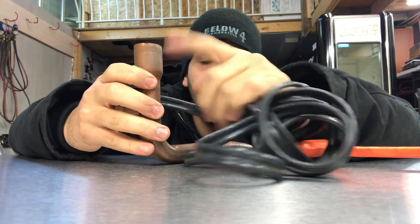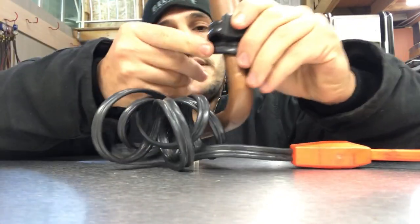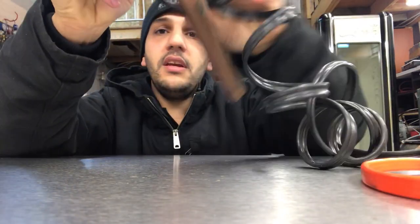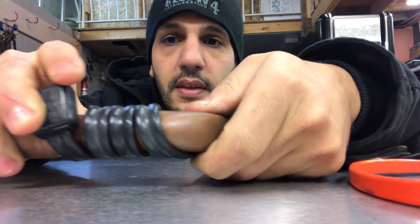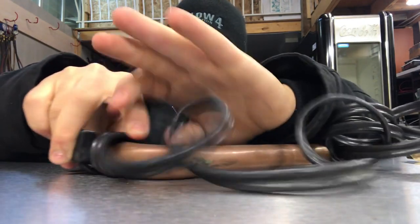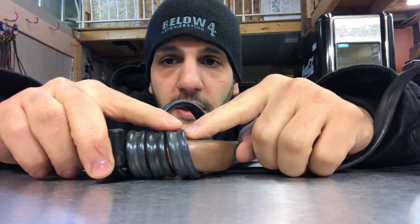This tip usually gets connected to the bottom of your evaporator coil. So start from the top and you go like this — you turn it around, keep on turning and turning. Try to cover as much of the pipe as possible. However, it is important that you do absolutely not overlap the heater on itself. You want it to look like this, and you just continue all the way until you run out of the heat tape. Just like this. Try to cover as much surface area of the pipe without overlapping the heater, and you should be good to go.